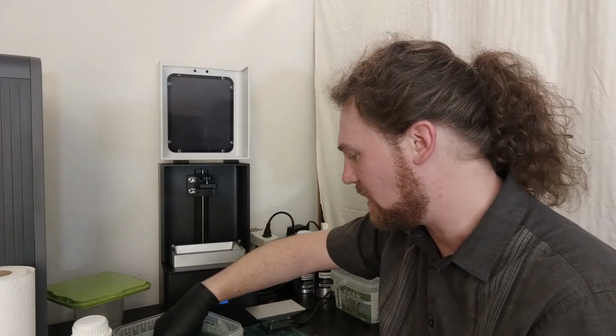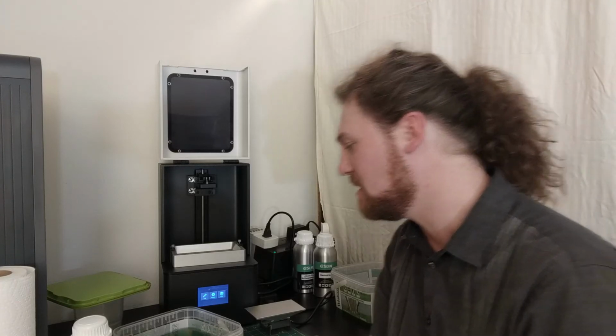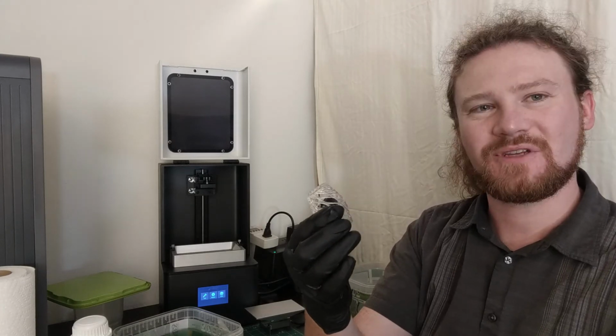Interesting, at the bottom of this container, there are some white, well, they appear white, particulate. It could be a filmy precipitate. I think that's the Simple Green. Yeah, that's actually quite a lot better. Okay, sorry. The Simple Green might have reacted with the resin that was put in there to solidify or precipitate out some portions of it. I'm squeezing this a little bit, and it has some give to it, some springiness, but it is a lot more firm than the failed print from before.